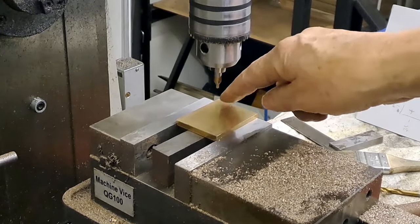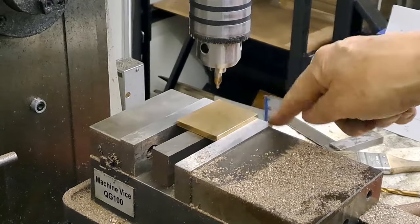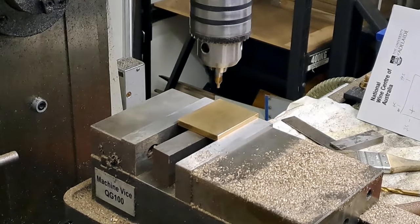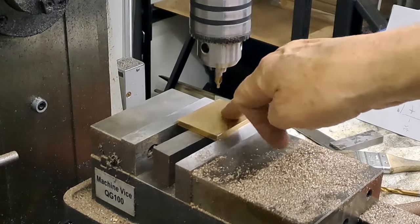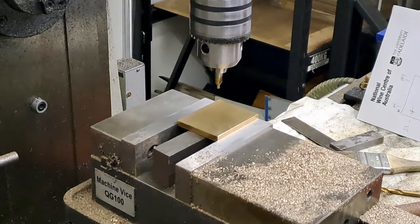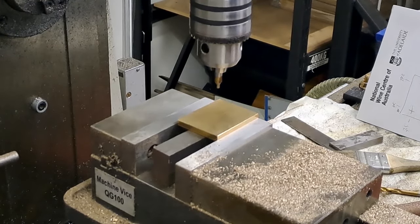So it's going to be center drill, drill, center drill, drill, center drill, drill, center drill, drill. Okay, I'll do one, then go off camera, drill the other three, and then I'll bring you back with this on the bench. We'll mark up and center punch for the big hole that's got to go in the middle, and then we'll move over to the lathe to get that one drilled and bored out. All right, guys, here goes. Going to get noisy.